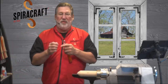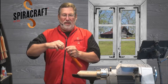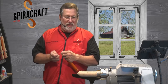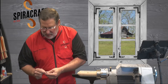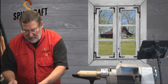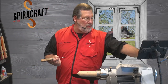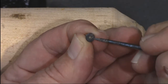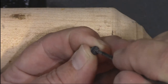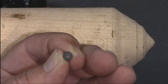It's a big plus for me to have the extra help because I am a one-man band around here. When I change these cutters, I always take my ice pick and go into the Allen head of the screw to clean it out, so that you don't strip it if it's really stiff or tight, and so you don't tear up your little 16th-inch Allen wrench.